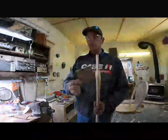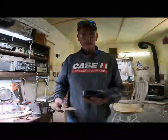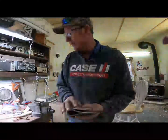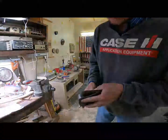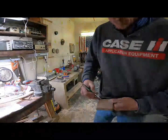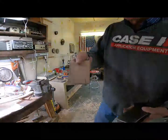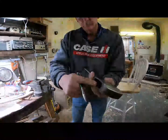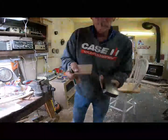So we've decided on this wedge. First thing that I do is I gotta fit it to the axe eye. So we got a little trimming to do there. I'll get it fit to width. Just gonna take a rough gander here. Gonna take a quick measure of that. So we're gonna cut that guy right there. Remember, eyes taper. This is more narrow than this. This is wider than this. We're gonna make our wedge match that.